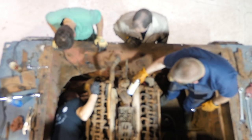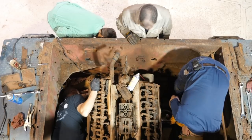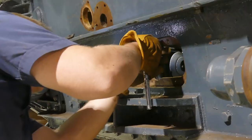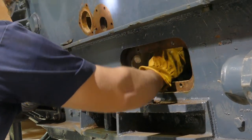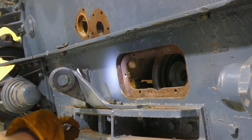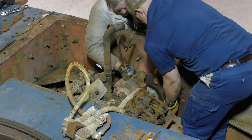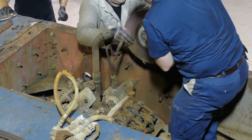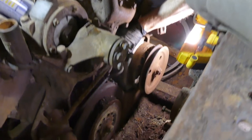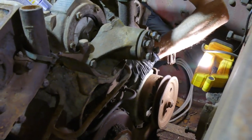Today what we've pulled off so far is the rear pulley that mounts onto the crankshaft, and along with it is the harmonic balancer. We need to free up some more of the components on the rear of the engine so that as we begin to lift, we can move the engine to the rear in order to clear enough bulkhead so that the engine can be lifted out. The next bit that we're working on is the generator, to free up space so we can move the engine to the rear to lift it all the way up.